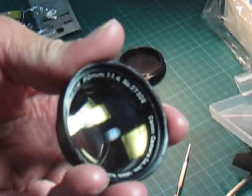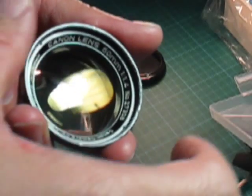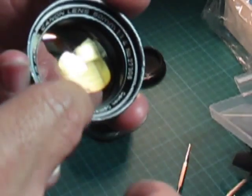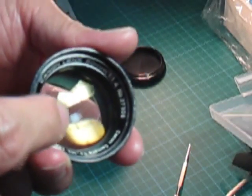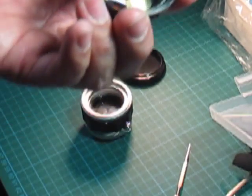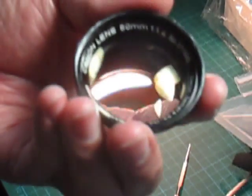You can see the Canon ring. What you do is either get a piece of rubber or stick some sticky tape around the side and twist it counterclockwise. This entire black ring will come off, and when it comes off you can take out the glass element — but you've got to be very, very careful because the moment you unscrew this, the entire glass element will just fall out. I'd advise putting it onto a soft cloth before unscrewing, so it falls out safely and doesn't scratch.